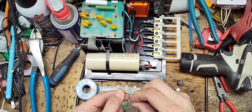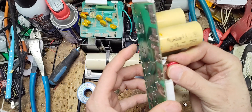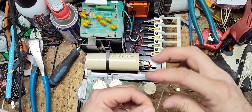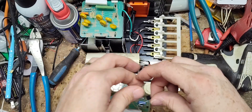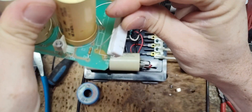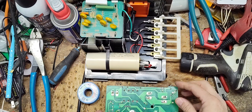There's no polarity on the MOV, so we'll spread the legs out a little bit and bend one leg over so it doesn't fall out as I tilt it upside down to solder it. Then this thermal cutout — based on Gallagher's recommendation from a long time ago, you spread the legs out on it, which I think helps heat dissipation on the device. It goes in right there into the holes marked TCO for thermal cutout.